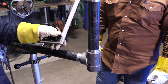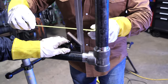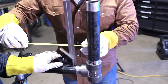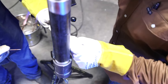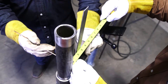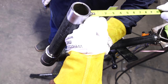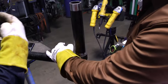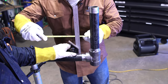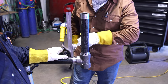Just make sure this is locked down on your tri-square, a regular square. What we're doing right here is moving the square to an even number, measuring the inside first, then coming up to the top and measuring here. You can see it needs to come in a little bit. Good there — going to tack the throat.